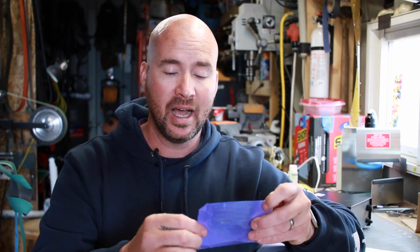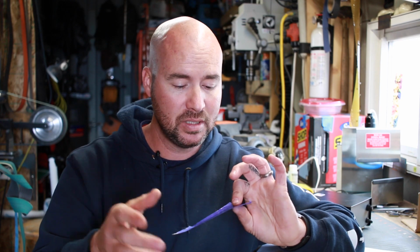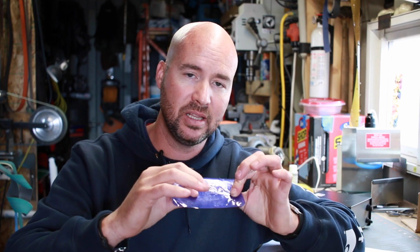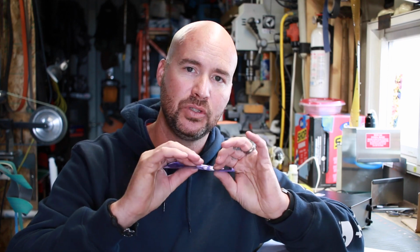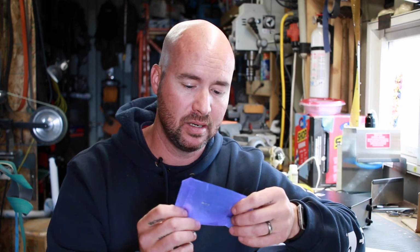Once you've got your stencil made, I've tried holding them in place with electrical tape and masking tape, and I find that both of them start to degrade the stencil quite quickly. They'll stick to it or they'll peel it apart. So what I do, just like in that demonstration, is typically most of the time I'll just hold it in place, and once I start going on there with that brush and the electrolyte solution gets underneath there, a tendency is it kind of sucks itself to the metal, just like if you had anything wet and you put a piece of plastic on it, it kind of squishes itself in. So I find these stencils do the exact same thing, and just holding it with my fingers, I'm having really good results doing it that way, and then I don't have to tape up my stencils and they last longer.